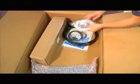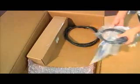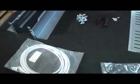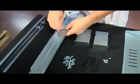In this installation, we're also going to install power distribution. With the UPS and EBM installed, it's time to open the box that contains the rack power module, or RPM. Again, lay everything out and consult the owner's manual to verify that you have all the necessary parts. Check mounting rails and ensure they slide easily.